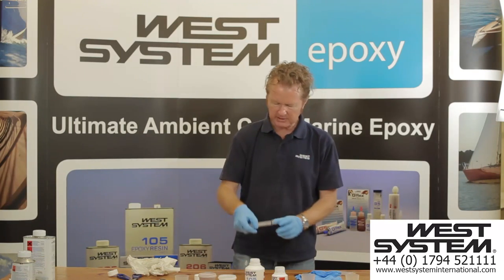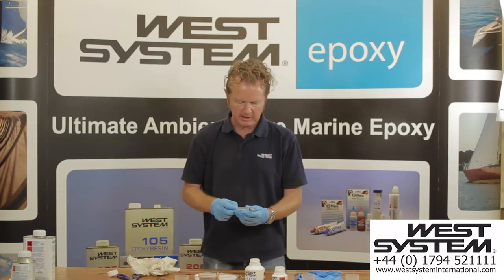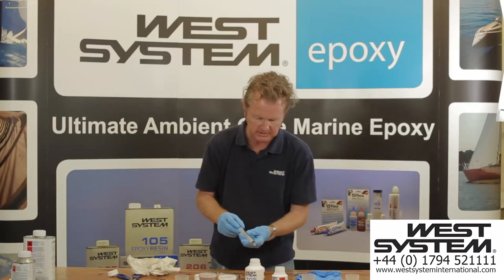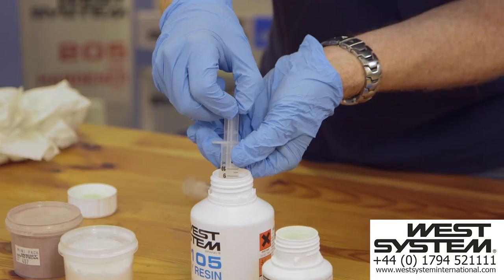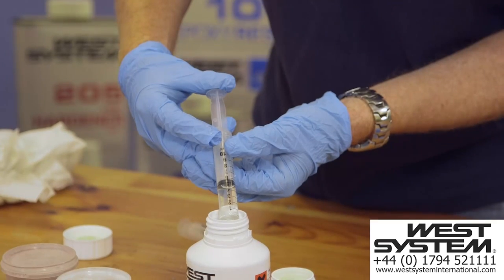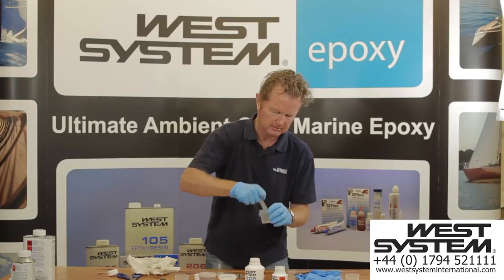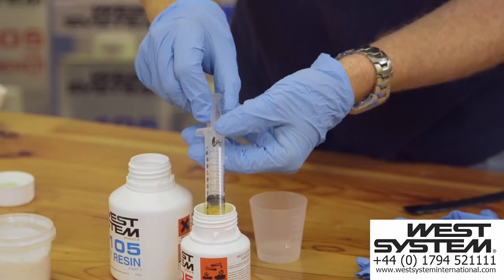And that way, we can then mix up a very, very small quantity. In fact, we can mix up 6 millilitres. Really perfect quantity for very small repairs on a boat, or perfect for model makers. I'll just use the syringe to draw some material into the body. 5 millilitres of resin, and 1 millilitre of hardener.